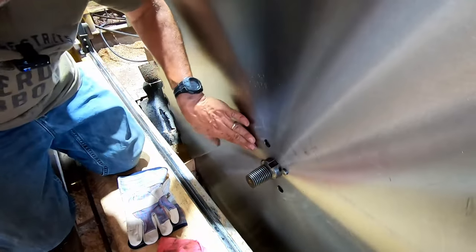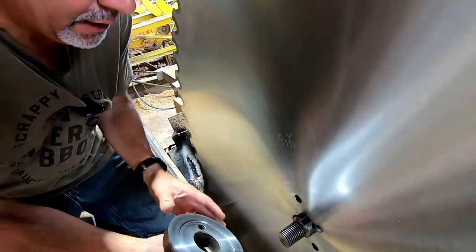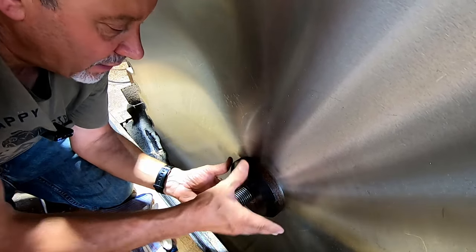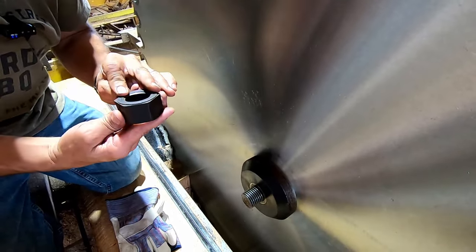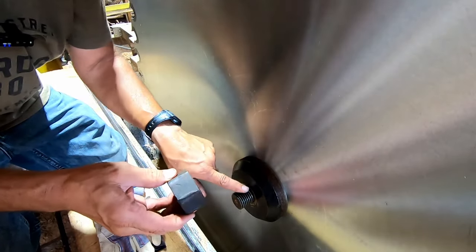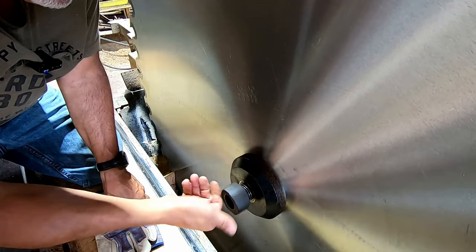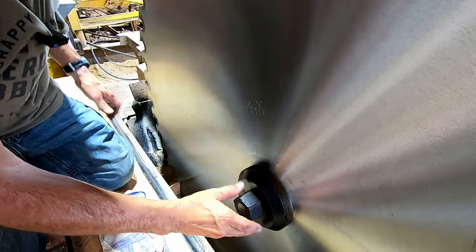That looks nice. So now we're going to grab the collar, and again, we're going to line up the holes onto the shear pins, and you'll feel it engage. There it goes. We're going to put the nut on loosely by hand, and there is an inner and outer. It has a flat surface on it which meets the collar, and we've pretty much checked everything. Now, just hand tight. Now we're going to load the blade.